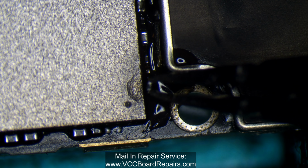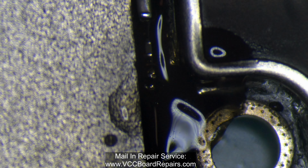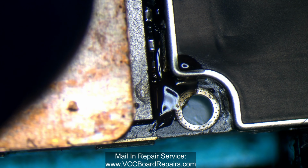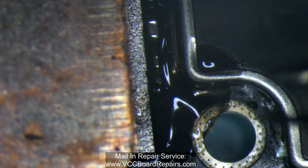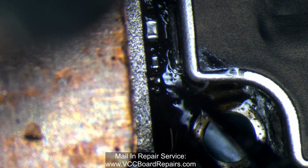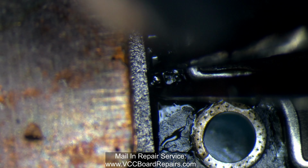Now there's a few ways to do this. You can do hot air or iron. I like to do hot air. So what you can do is add a heat sink on the NAND and then come in with the same hot air as I removed it. Now this is a tiny component and none of the legs are on ground, so it will install pretty easily.